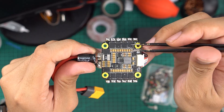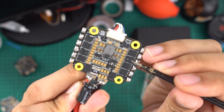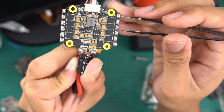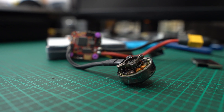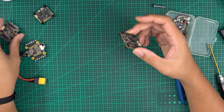Going through individual components, let's start with the ESC. Look out for the larger MOSFETs on both sides. If you can see a pin has penetrated a specific MOSFET, best case scenario that motor just won't spin, but worst case it might smoke your motor. That's an indication you should just throw the ESC away.